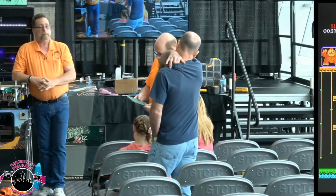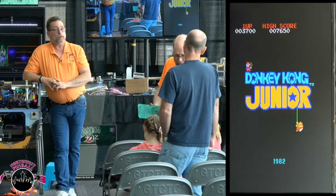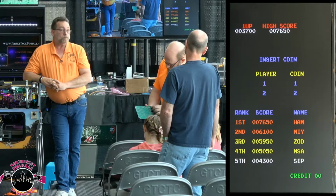What you're looking for is that your tip should have a little bit of gap, because you need airflow. They wanted to be able to get the solder suck. But you don't want it so large that you're missing the pad, basically. Whereas this one's a much larger pad.